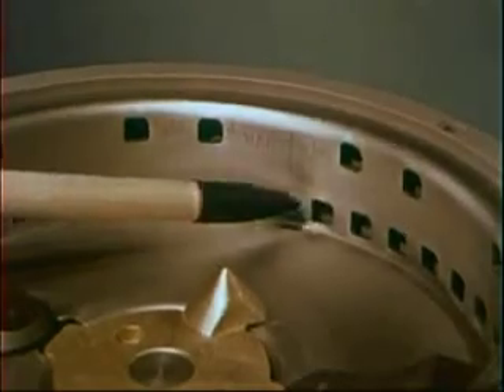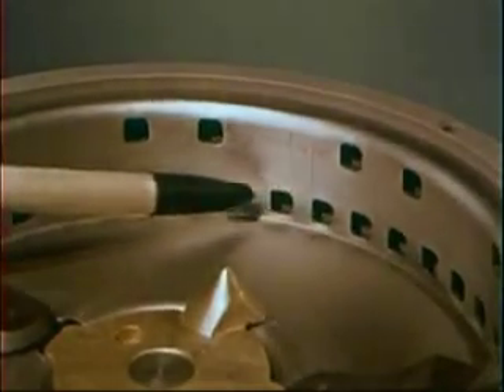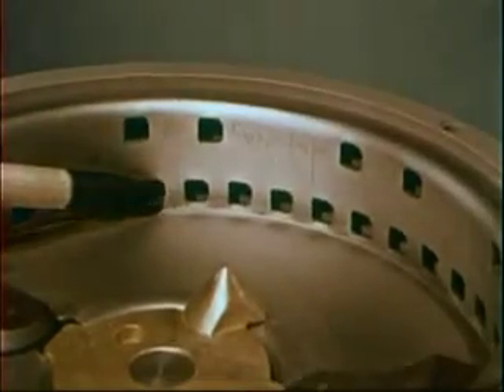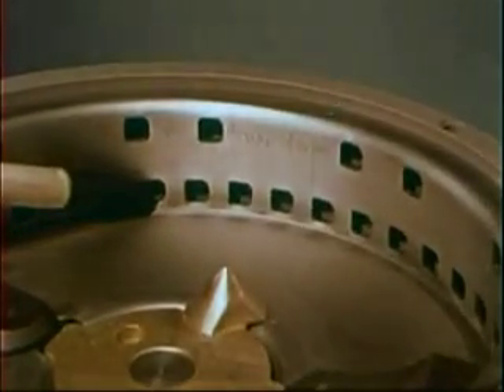These are the shredder ring openings through which, once all of it has been finely ground, food waste is carried by centrifugal action to be washed down the drain by the running water. Here are slow motion scenes of how a General Electric Supergrind Disposal works. See how it's cutting these grapefruit halves down to size, never giving them a chance to escape from the cutting action of the carboloy cutter.